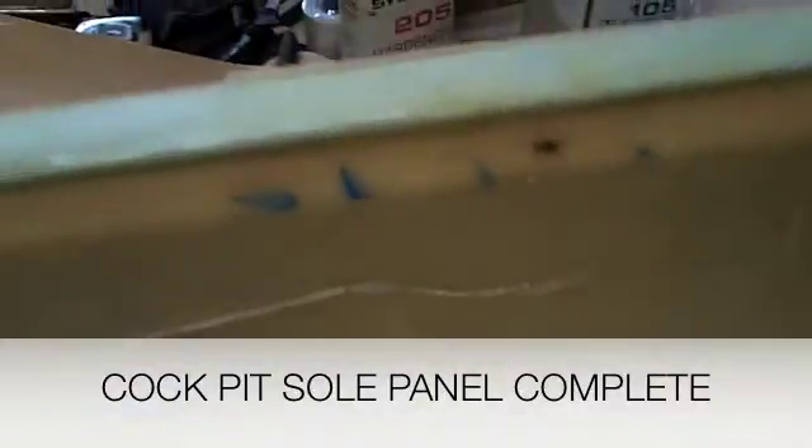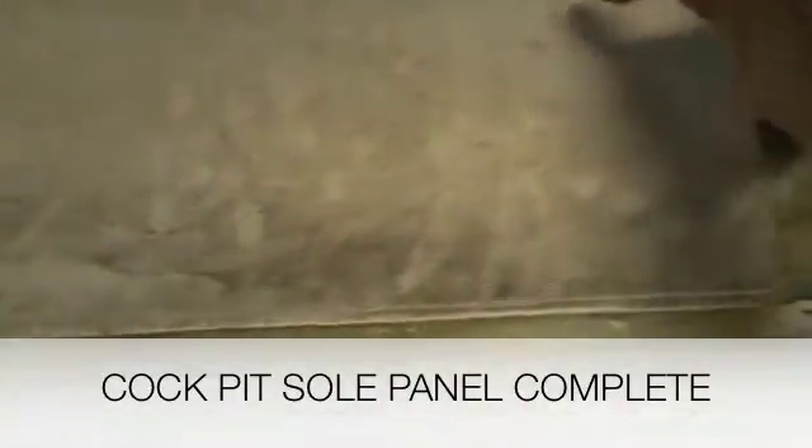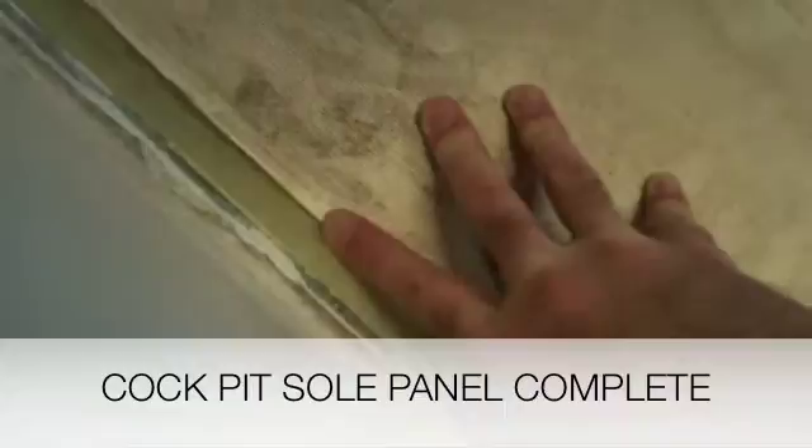I just got done molding the floor panel here. This was cut out of the deck — it's the original skin — and you can see I have left the flange in the molding. I have a slight crown from one end to the other, just like the floor of the deck, and it's got two layers of fiberglass on the back. I'll be dropping it in there. You can see there's also a chamfered angle of the floor, and the flange allows it to overlap up on top.